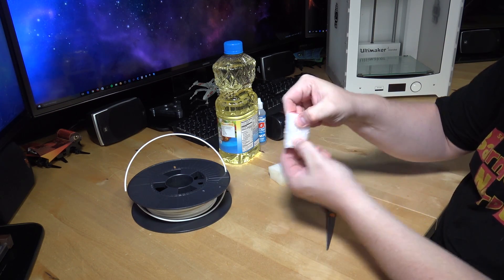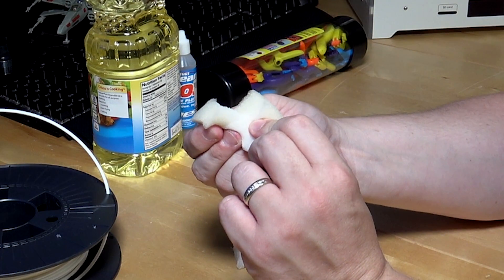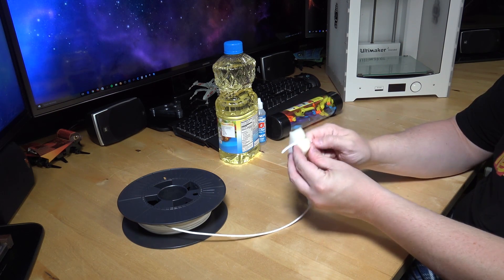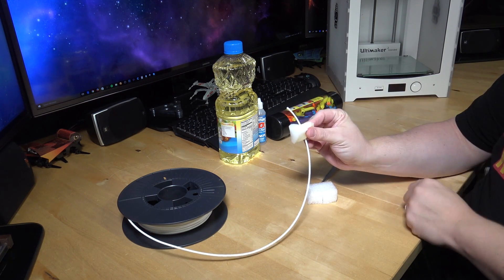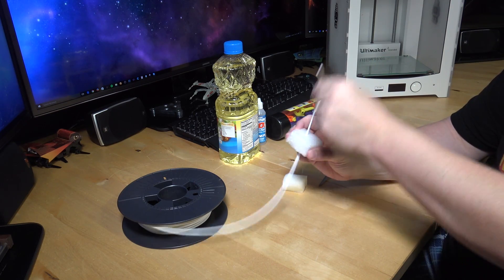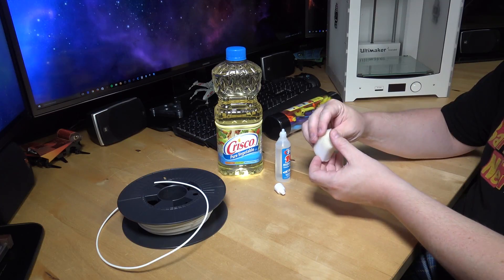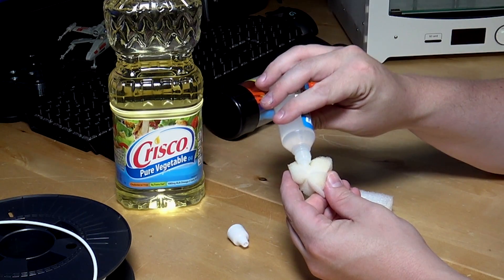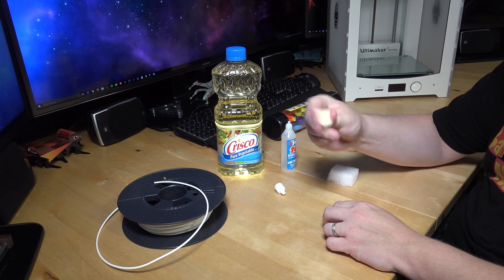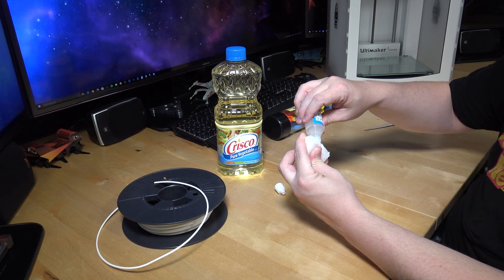So they end up like a little Pac-Man. Make sure you have sharp scissors. Now we have a roll of filament here — this is just white PLA. You take the little crease and put the filament right in between it, so the filament passes through the center and it moves through it nicely. The dense foam creates a little bit more drag, but that's going to go away in the next step. So the next step is to take your vegetable oil, or as I prefer, the silicone oil, and just spread open the foam and put a couple drops — I'm talking like four or five little drops. Squish it together in your fingers so it absorbs into the foam. On the denser foam, don't use as much — maybe three drops. I would recommend re-oiling these after huge 3D prints, like stuff that's 15 or 20 hours.